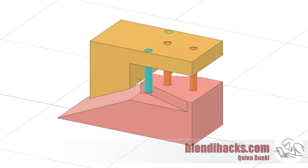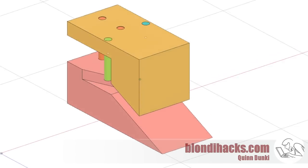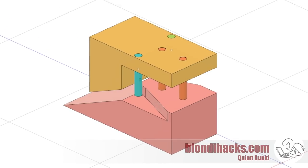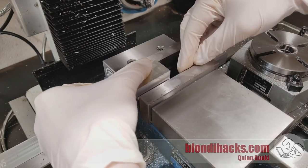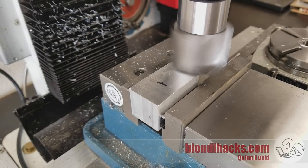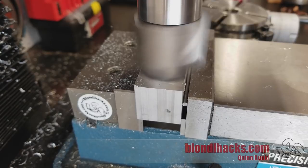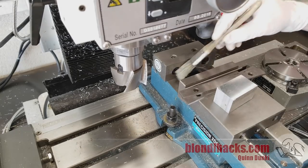A quick reminder — here's the fixture that we're building. This is going to make zero sense if you haven't watched part one, so go watch that now if you need a refresher. We're going to be building the second half of the fixture, the yellow portion, and the pins that connect the two halves. We cut the stock roughly to size previously and now we're going to square it up, grabbing an appropriately sized parallel and clamping it with some round drill rod to square up our first face. One parallel isn't sitting under the stock, but at this stage it doesn't matter because the fixed jaw is doing all the work.